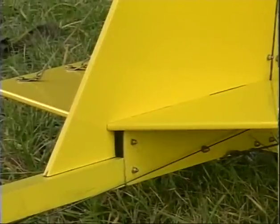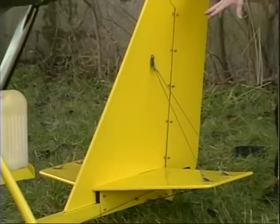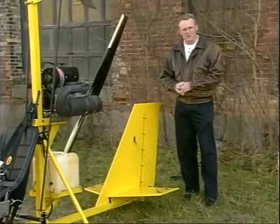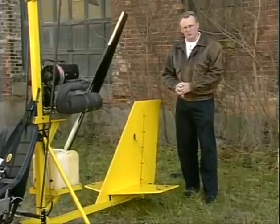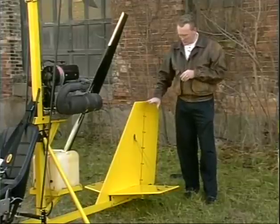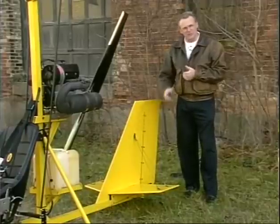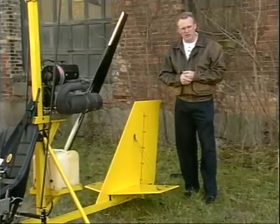What you're looking at in this airframe is the prototype tail. It has a Sitka spruce leading edge, trailing edge, and hard points, as well as a foam core and a fiberglass shell. That basic construction pattern is very similar to the plans that you will find on the Honeybee Gyro. The actual production version of the tail, if you buy the airframe kit, has fiberglass clamshells with the same internal structure, and it all gets bonded into a one-piece unit. Those one-piece units are bayonet mount, and there are three bolts that finish off the arrangement on the tail for mounting it to the airframe, a very simple tail to mount to the airframe and yet strong at the same time.